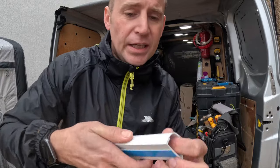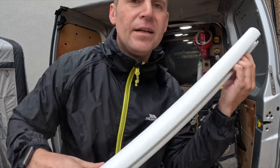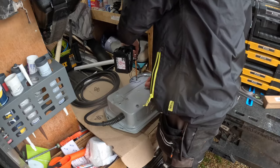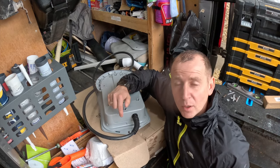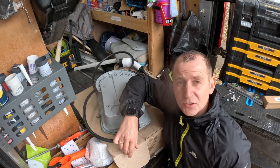Then this trunking simply unclips like that. What I'm going to do is use the D-line clips with self-tapped screws to secure the trunking to the wall — it'll also secure my cable. Now I've just got to get the Zappi sorted out. Working in these conditions is an absolute nightmare. One thing I need to be careful of on this one is drilling my 25mm hole as far back as I possibly can, so the cable will swoop in nicely and you won't see too much of it.